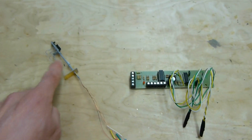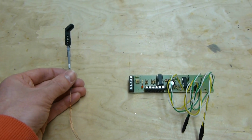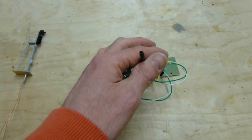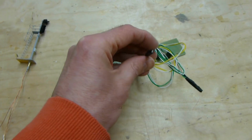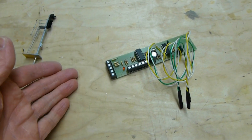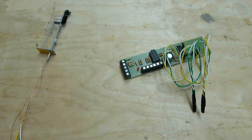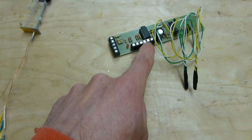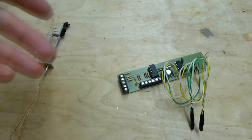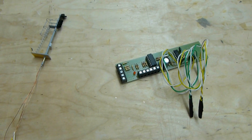So as a train passes this, it triggers the two sensors which are placed through the sleepers. It then sends a signal to red. After a period of time, or when it's past the next signal, if it's linked through the send and receive wires, it will change to the yellow, etc., and then back to green through its sequence.